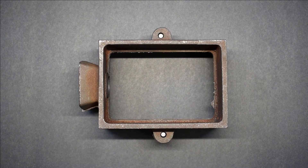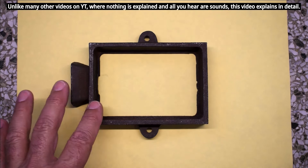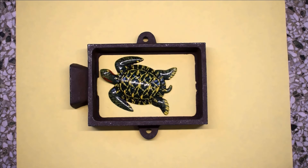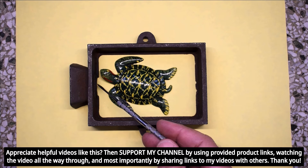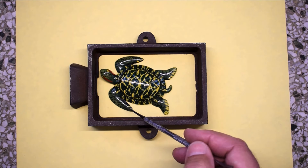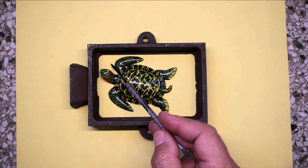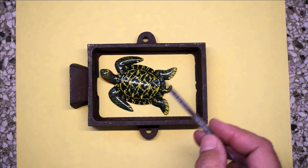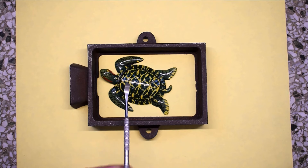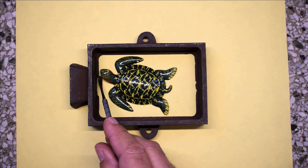You need to position one half of the mold on a hard, perfectly flat surface. I don't want to do this directly on the floor because the sand is a little tacky, so I positioned a piece of paper between the mold and the floor. This position right here looks pretty good. I want to be able to pour into the head, fill up the entire body of the turtle, and have the liquid rise all the way up into each one of these legs. Now the head of the turtle is angled up, so when I pack the sand I'm going to start very carefully, sprinkle it all around evenly, push it down by hand, and keep the turtle from moving out of position. I'll need to scrape away any sand accumulating under the turtle's head.